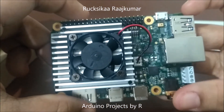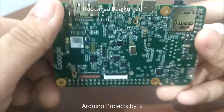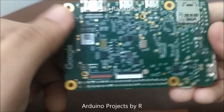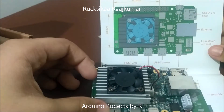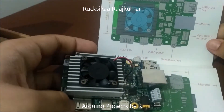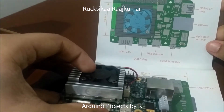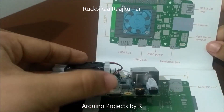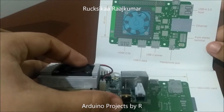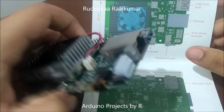We've got so many ports over here and a GPIO pin header. We've also got an audio jack, a micro SD card slot, and camera connectors. You can find the system on module beneath the heat sink. This is the HDMI 2.0 port, and this is the USB-C port for data communication. You'll be using another USB-C port for power. And this is a headphone jack — 3.5mm. This is a 4-pin stereo terminal.